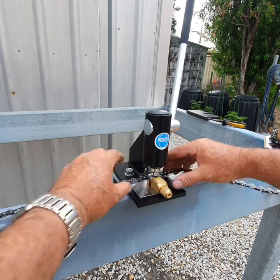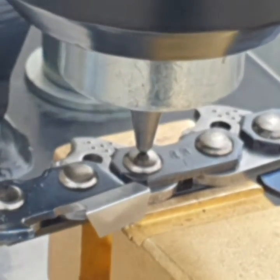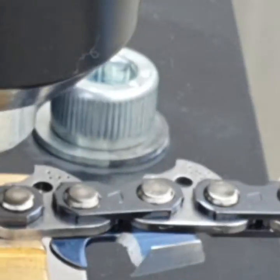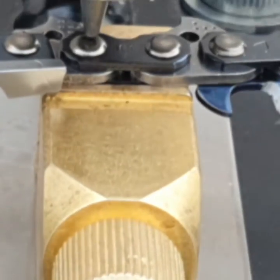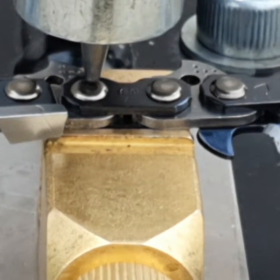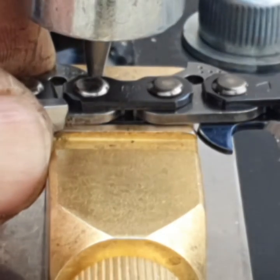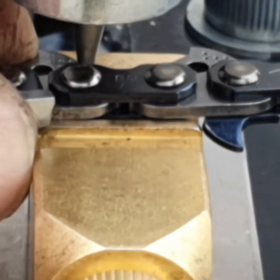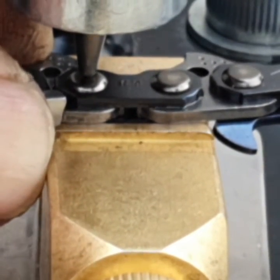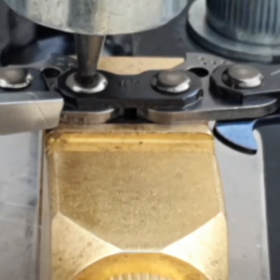You've got to make sure the two rivets — let me zoom in there, because I can tell you the instructions leave a lot to be desired. You'll notice that the two rivets are right in the middle of that vice. The most critical part is getting that punch right in the middle of the rivet.